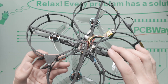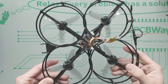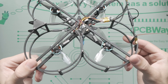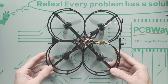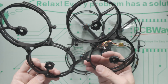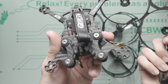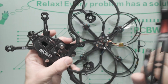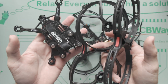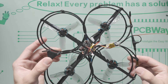This is 3D printed in Bambu Lab carbon fiber PLA and I've gone through several versions. This one has 30-millimeter standoffs, which I'd probably reduce in the final version. The electronics are from the CineLog 35 v1, whose original frame and propeller guards come to about 109 grams. My frame right now is about 60 grams.